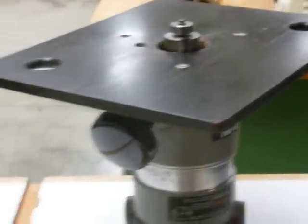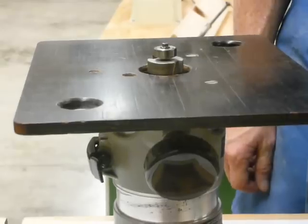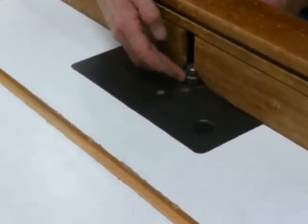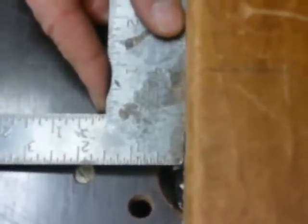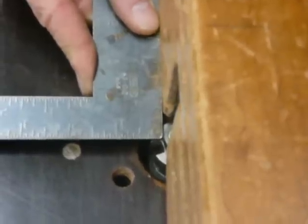It's very important that you lock the mechanism for the base — that's this lock right here. Lock that in place so that the table can't move in relationship to the motor. Now I can set the whole thing back in here and put my fence on. I'm going to adjust the router table fence so that the carbide cutter at its maximum distance is one-quarter of an inch away from the fence. I'll take my steel square and move the router bit back and forth a little bit to check that it's lined up with one-quarter inch — that's very close. I'll clamp my fence in place.